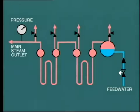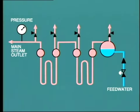We've just talked about load rejection causing a steam pressure rise, but this has other effects too. The sudden rise in pressure causes many of the steam bubbles which are contained in the water to collapse, with the result that the boiler water level in the drum falls rapidly. Most control systems are able to cope with this shrink by opening the feed water control valve wide to increase feed water flow. An incidental effect of this large quantity of relatively cool feed water entering the boiler is to help cause the steam pressure to fall back to normal.